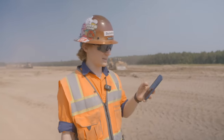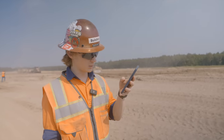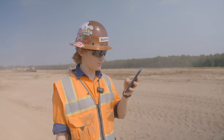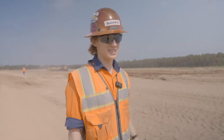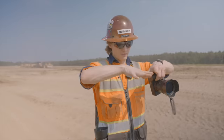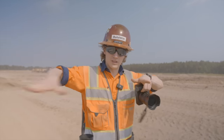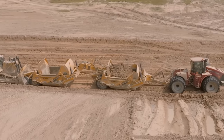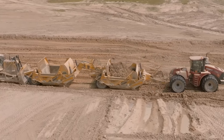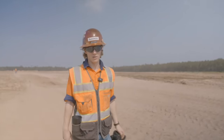I fact-checked myself — I googled the K-TEC 1233. It's described as carrying a heaped capacity of 33 yards, or 25.23 cubic meters. Struck capacity is around 17 yards. Struck means if you filled it with water — wherever that water level sits even with the sides is the struck capacity. Heaped is all the extra material you can mound on top. So as it's loaded, the material boils up and heaps there — that's that 33-yard heaped capacity.